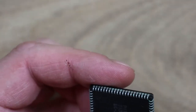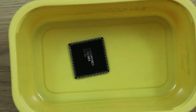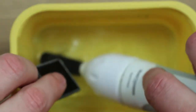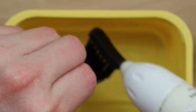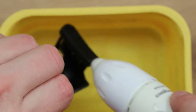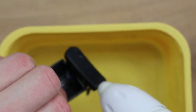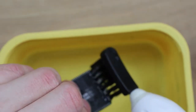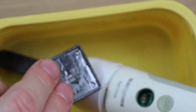Hopefully that's not making too much of a racket on the microphone — I'm just going to sit that in there to soak for a bit. Now I'm going to activate the brush again and try to get in here with some of the liquid. One reason I've used a tub with wide sides is because this will kick up the liquid being used. It's really worth bearing in mind that if you start to use isopropanol or other fluids you wouldn't want in your eyes, you really need to think about wearing goggles — that's one of the downsides of this idea.